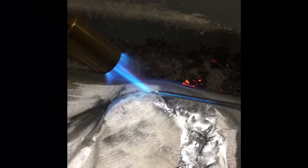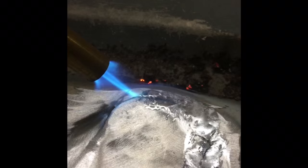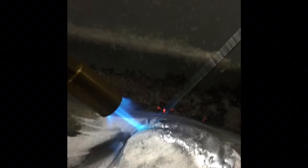Rub it in there, rub the rod right on it like a pencil — that's what you're doing. Nice thin layer. It's really easy to work with. So you just keep coming around. It's kind of like soldering — a lot like soldering. See how that melts? Keep it going right into the flame. We got a big gap, we're going to have to build it up.